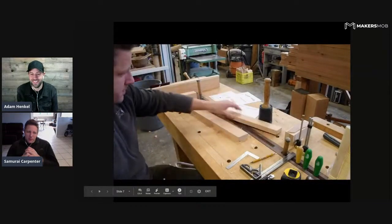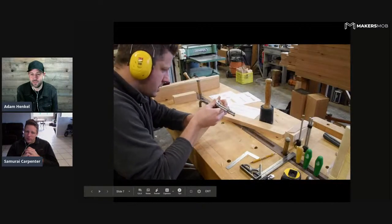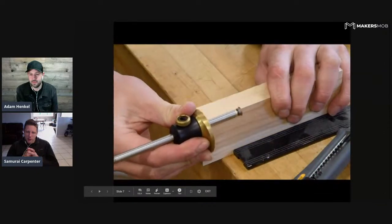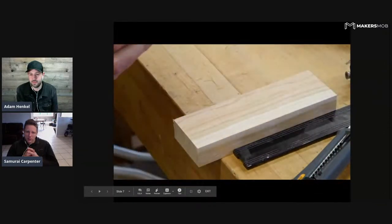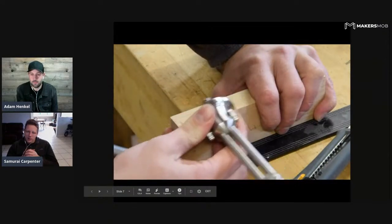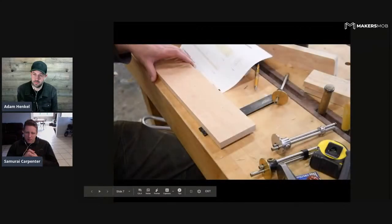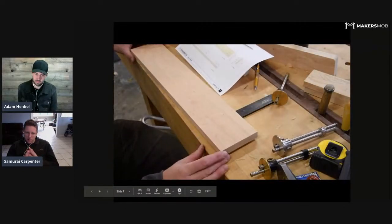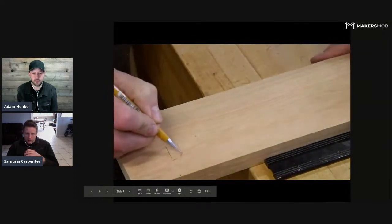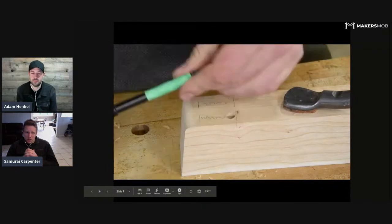Yes. If you're going to do solely hand work, you definitely need sharp chisels. So here I'm using my dual marking gauge, and this is a single marking gauge. For any kind of joinery, if you don't have these marking gauges from Lee Valley, you're just not going to get the accurate results that you want. So as far as layout goes, the dual marking gauges are kind of a must for any kind of exposed joinery. So get some of those if you want to not look like a schmuck.